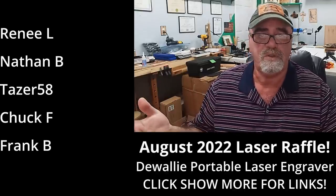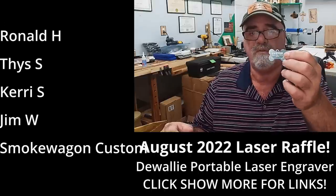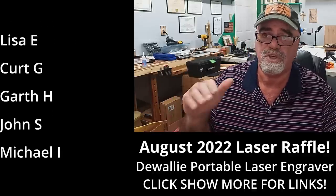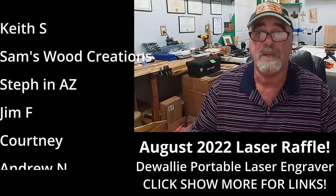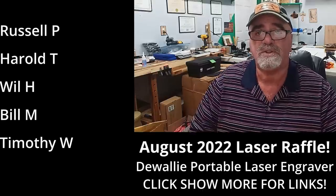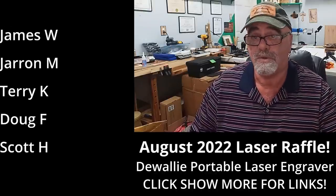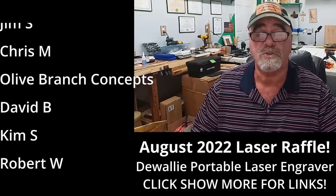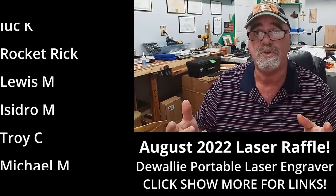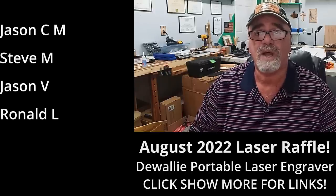And you can have products that you run off. So you might have 50 or 100 of these dog tags, and you only need to create one template. And that's it. And then you position your graphics. With the fiber laser, once I had it on the workbed, I actually deleted the outside part so that I could light it and see exactly where the graphics were going to go. So that's another thing too. On the fiber, you want to actually delete the toolpath so that you only see the graphics themselves. Or you could use the toolpath to align the edges. Completely up to you. Everybody has their own style in doing this.